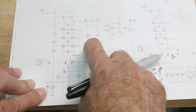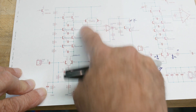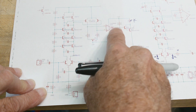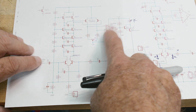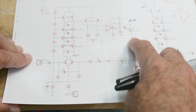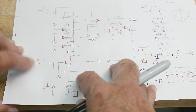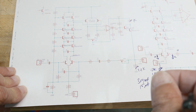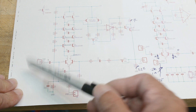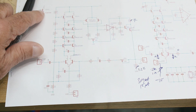It's just a source follower, so I'm thinking that's okay with the balance here. It's picking off the differential here and buffering it before it goes into the transconductance amplifier. Then there's some feedback if you want to peak it. So let's go ahead and hook something on the input and we will sweep this filter.